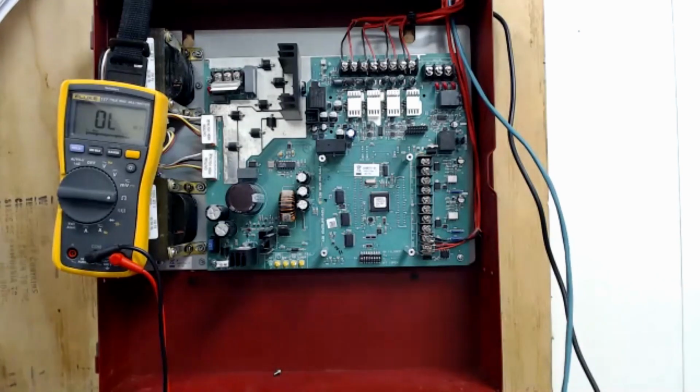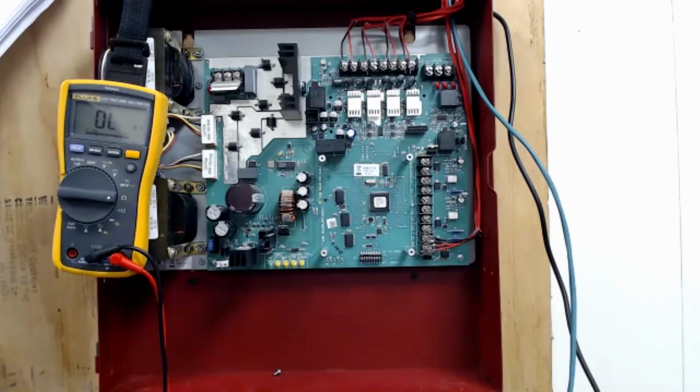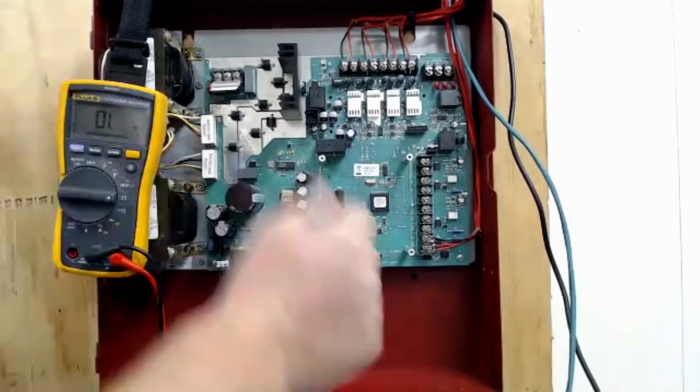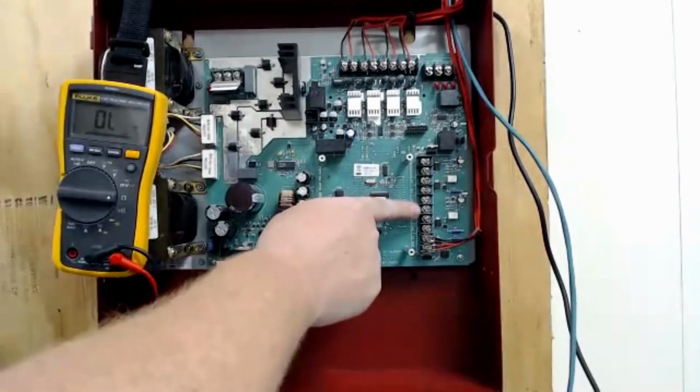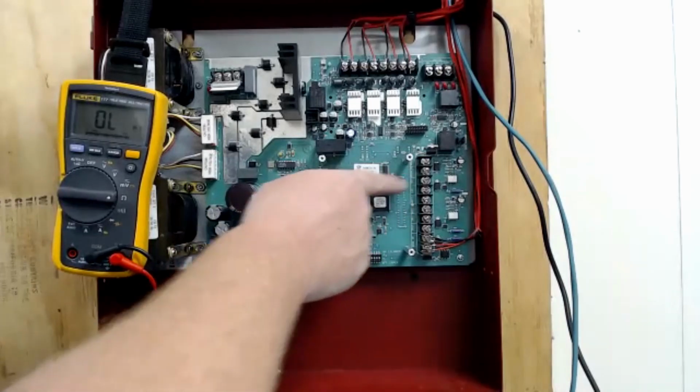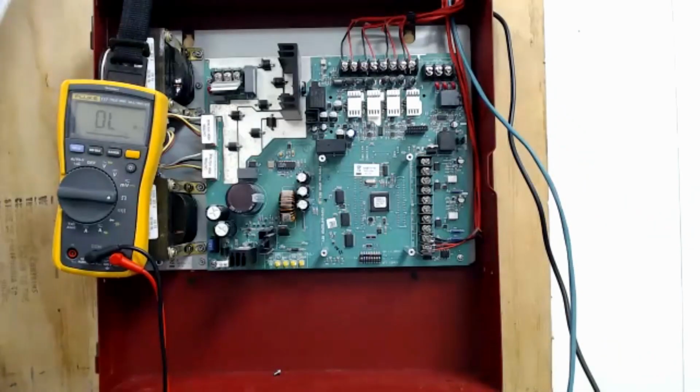And then 5 on and 6 on is selective silence. And it says NAC outputs 1 through 4 are controlled by input 1. The sync input is ignored. Control input 2 determines when selective silence for all outputs will occur. So what that's saying is you have something coming in telling it, okay, we're in alarm now, and that's not going to be a silenceable trigger telling it it's in alarm. And then you have another control coming in. We don't really use that feature.